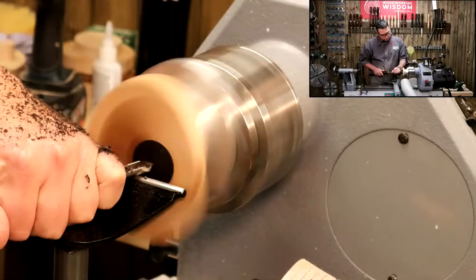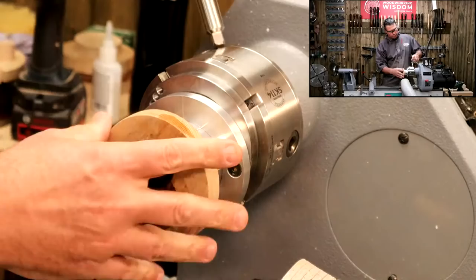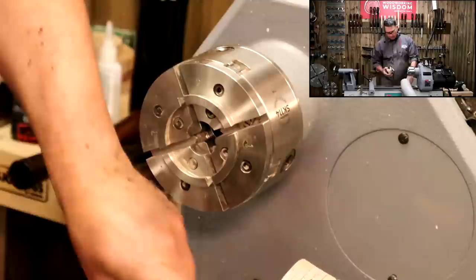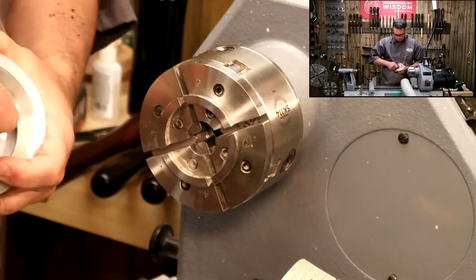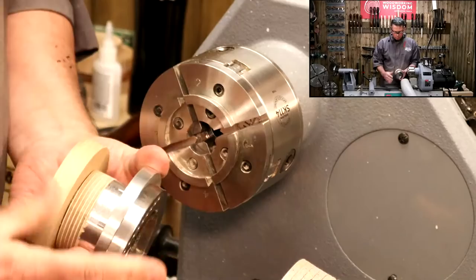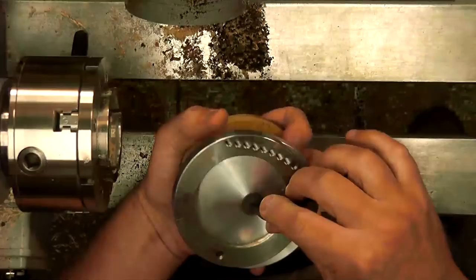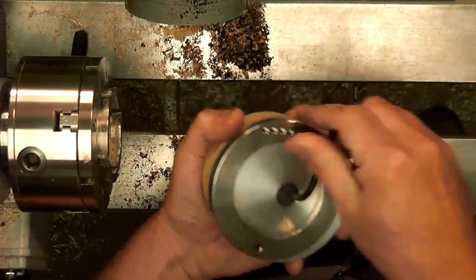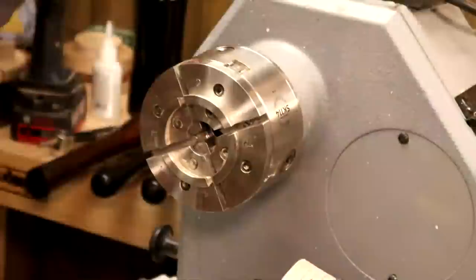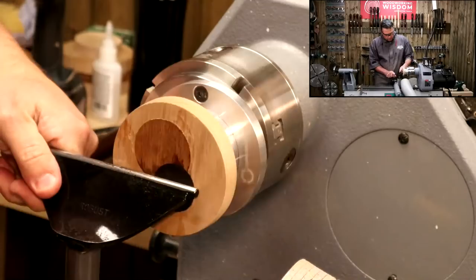Let's just do one more and that'll be it for this one. We're going to go with the palest timber I've got. All I'm going to do is pivot the center pin — I'm not going to worry about the outside or the hinge setting, just undo this one. Let's go halfway between — I want it somewhere in between. Once you start using this chuck you'll get to grips with it fairly quickly, and your imagination can start working out what you're going to do next. Lathe is back to zero again, turn the machine on.